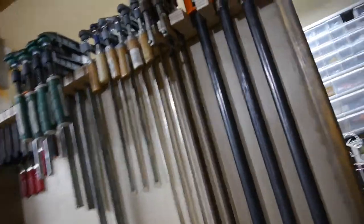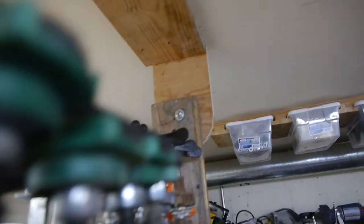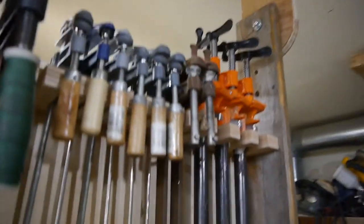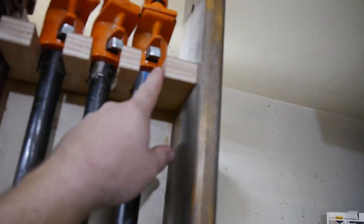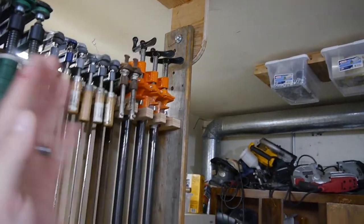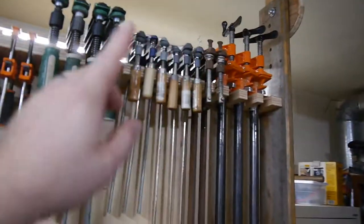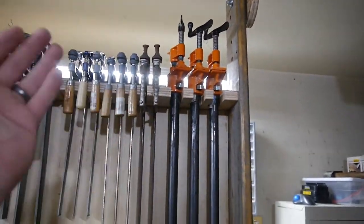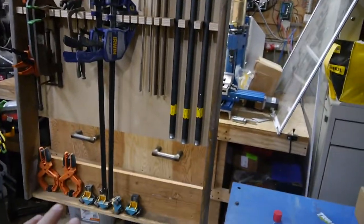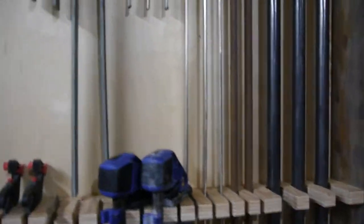A little bit of rocking, but I offset the hinge location as it relates to the width of this board out past the center point here. Meaning that as gravity and weight tries to pull this down, it'll want to kick over this way and maintain a bit of a back angle so these do not fall out and the whole thing stays in a reasonably rested position as it relates to the vertical axis here.